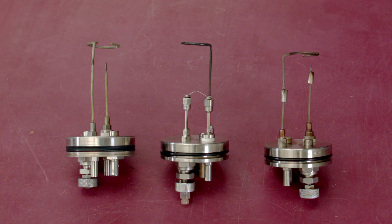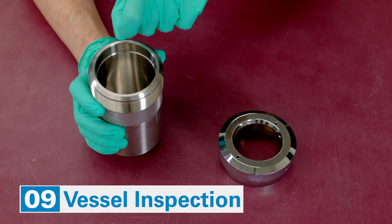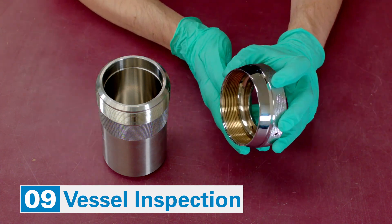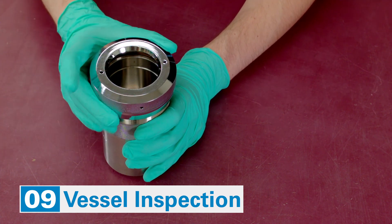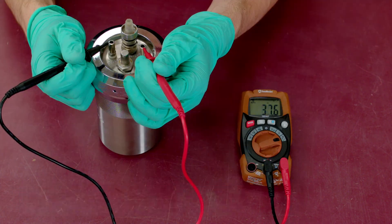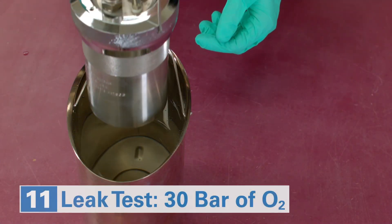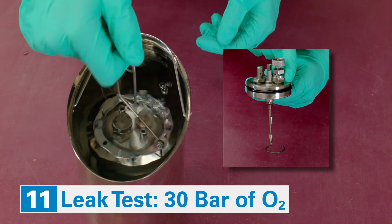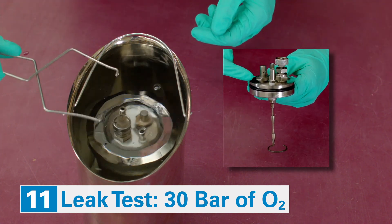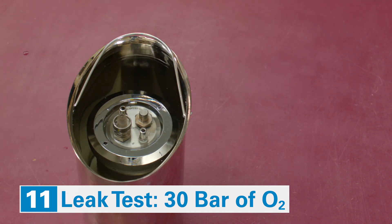Your head is now ready. Visually inspect the vessel cup and note the condition of the sealing surface. Visually inspect the screw cap — make sure it is free of deformities and that the threading is in good shape. Take a multimeter and check the resistance between the electrodes. Pressurize the assembled vessel, put the vessel in a bucket of water, and watch for bubbles in the valve and electrode area. If none are observed, your vessel is good to go.